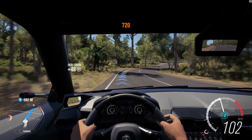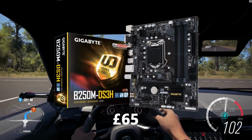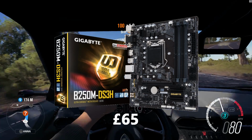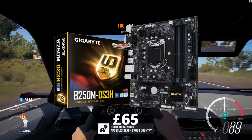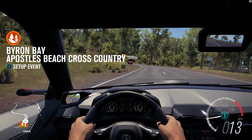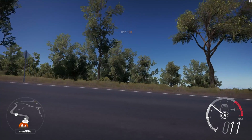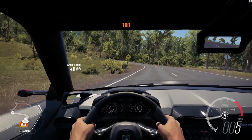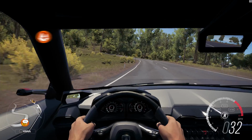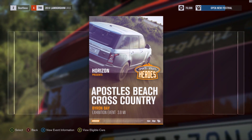The motherboard that we're going with is the Gigabyte GA-B250M-DS3H Micro ATX LGA 1151 motherboard. Again, we've gone B250. Seems to be a decent sort of budget choice. The B250 chipset supports DDR4 RAM, unlike that eBuyer PC that you saw earlier, which was only DDR3 up to 2400 megahertz. Does it have 4 RAM slots?